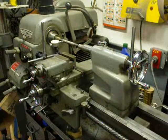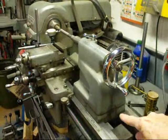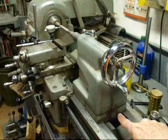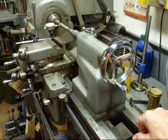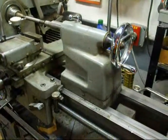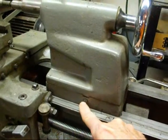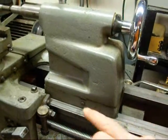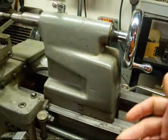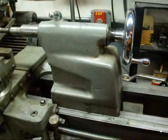Now we're standing at the Atlas Craftsman 10-inch. Right here are the index marks — I know they don't show up well. Even if they appear to read zero or line up, that doesn't mean they're necessarily exactly lined. This particular tailstock adjusts with a screwdriver slot on each side. When you make a setting, make sure you have two screwdrivers or two wrenches, so you're working back and forth from both sides — you can do it in almost a matter of seconds.